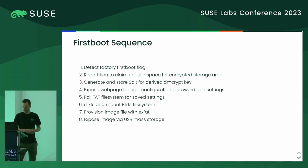So, that's, I think, just a list of what I went through there. This is what I have in the application itself. It basically just runs immediately after init. I do have BusyBox and some debugging utilities on the image itself, but that's, at this stage, unnecessary if I were to take the project further. One thing I'll mention is the configuration passing back to the gadget. It's quite an ugly hack, but works quite nicely.